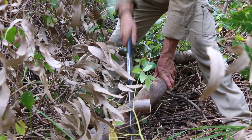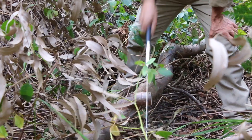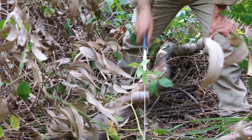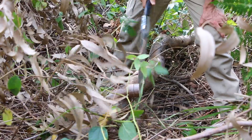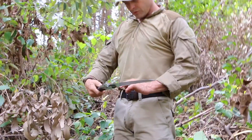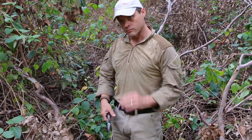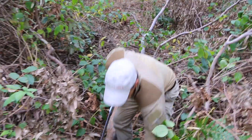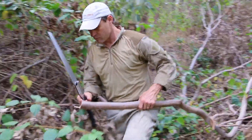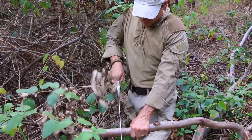Do you want to just cut a little bit off the end? I thought you should compare on the exact same piece of wood — it's good comparing the same piece of wood. So basically that size branch that you just cut, that's a really good tooth size for a live bit of gum. When the tooth's too big, you felt it vibrated and jumped a bit, and the problem with that is it can vibrate and jump out of the cut onto your hand.